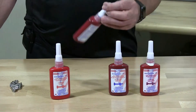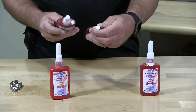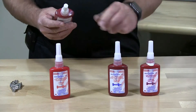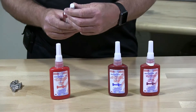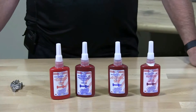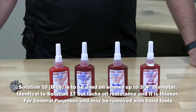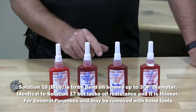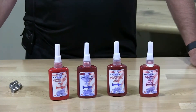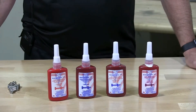Solution 10 is almost equivalent to Solution 17. The only difference is that Solution 17 is oil resistant, whereas Solution 10 is standard medium thread locker strength. They're both blue — Solution 10 is the regular version and Solution 17 is the oil resistant version. Both are removable and work on bolts up to three quarters of an inch in diameter.